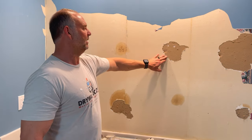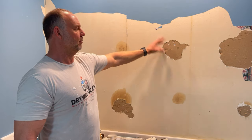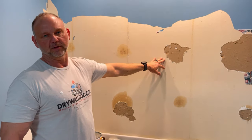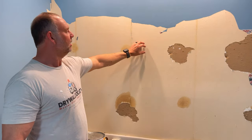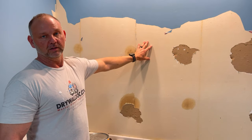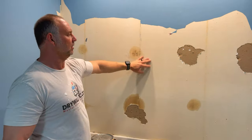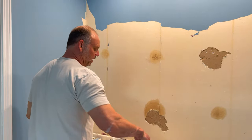But you really need to put something besides just mud over this, because it's just going to bubble and blister everywhere if you try to just mud over it. It just saves a lot of time priming it with something. Plus, we need to prime this, because if we just put mud over this without priming it, it's definitely going to bubble and try to lift. So we're just going to prime up every spot that has the paper on there. We're just going to make sure to prime it real thick